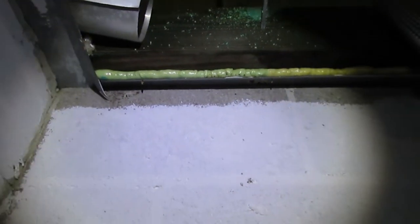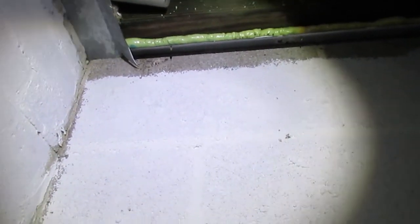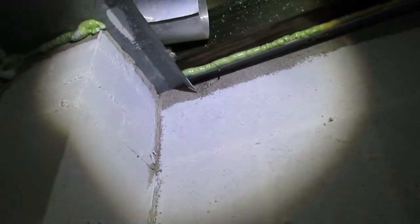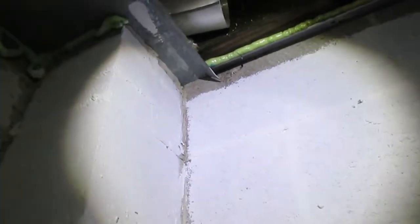The game plan is to completely seal the interior side of this wall as best as I can, filling any cracks with caulk, because air carries moisture more than anything else. I'm also going to apply the siloxane to the exterior side — it'll make that side water repellent but still allow it to breathe. You want the inside sealed, the outside water repellent but breathable. That's the right way to do this, especially in our climate here in the Deep South.